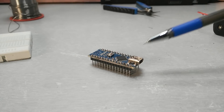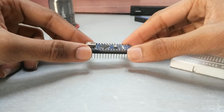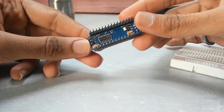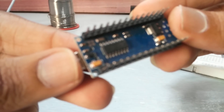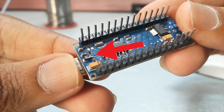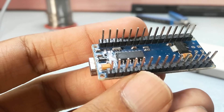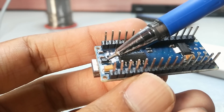There are two ways in which you can burn your Arduino. Number one: USB. If you were using USB to power your Arduino when it died, if you flip it around you will see a black component which is a diode. If you look closely, it has a small bulge or a swelled spot on it, indicating it is dead — which is the case for me. Replacing it will fix the Arduino.